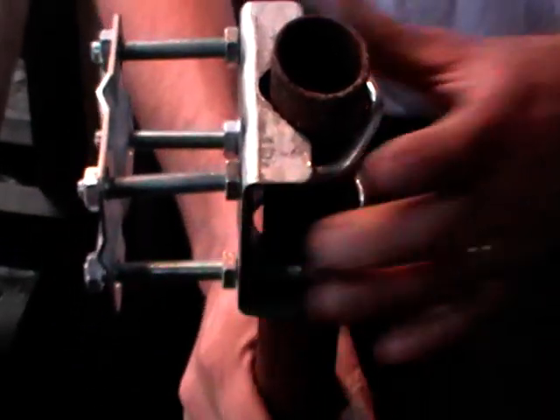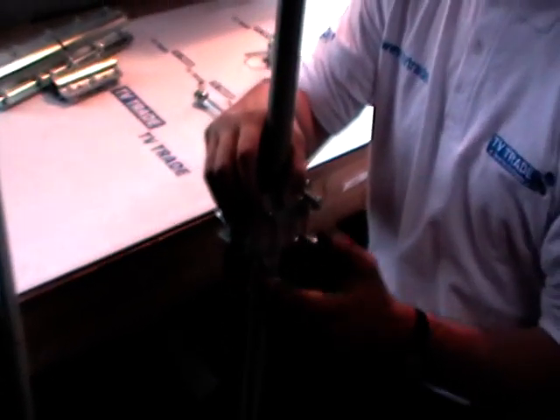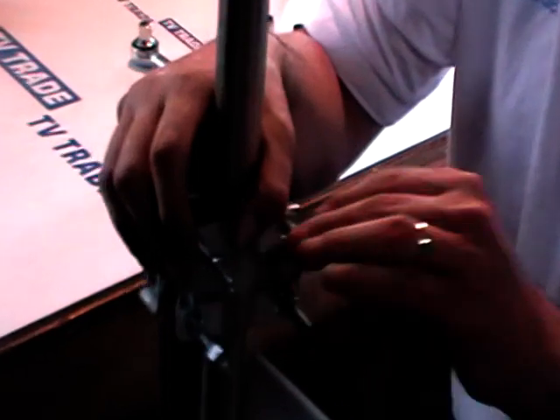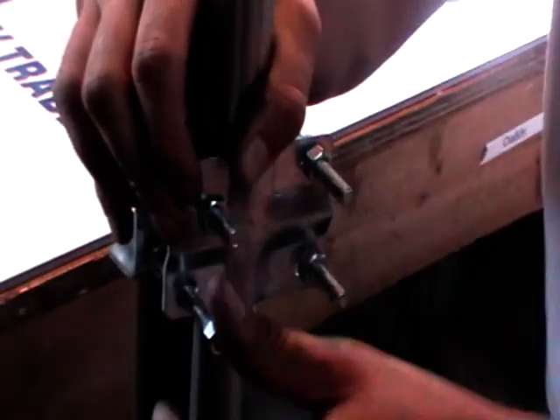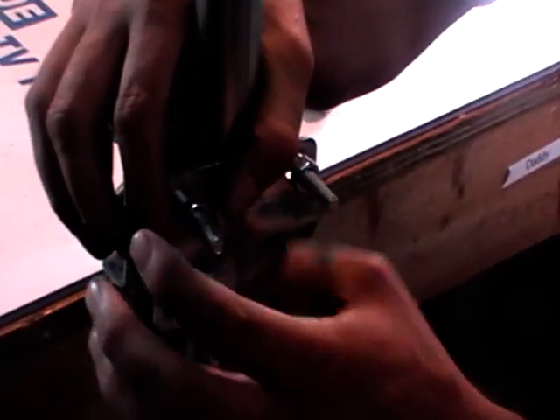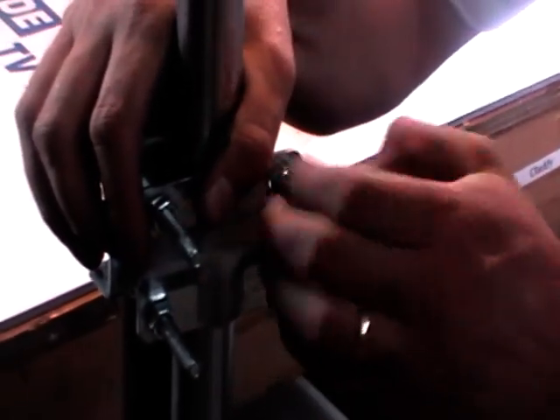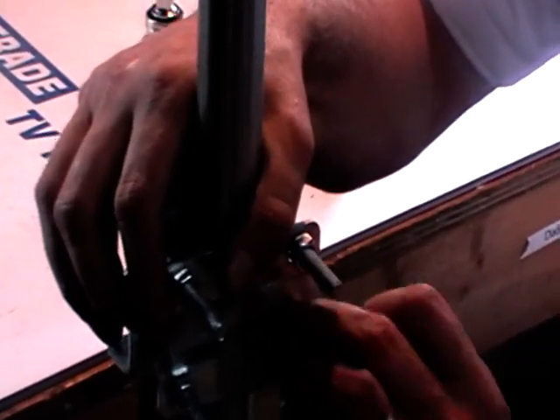At that point we grab the pole with our aerial, simply lift it into the air and slide it down. Initially I drop the pole to a comfortable position — in this case with the pole touching the ground — then push the clamp in and hand tighten the nuts on all four corners, until we get it roughly into a position where the nuts are at the point of being tight and all the slackness has gone out of it.